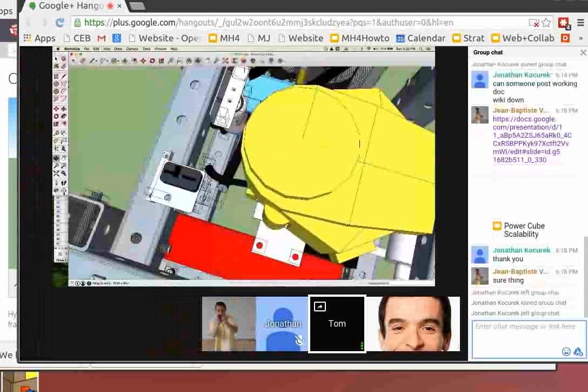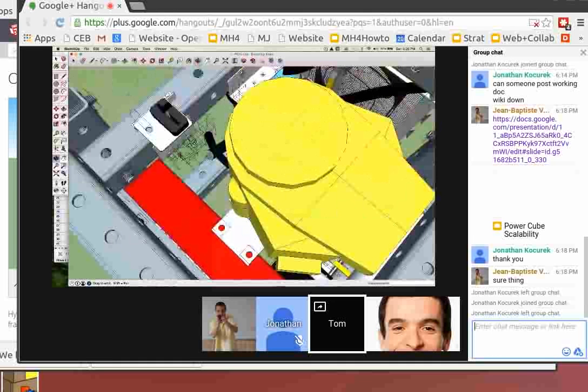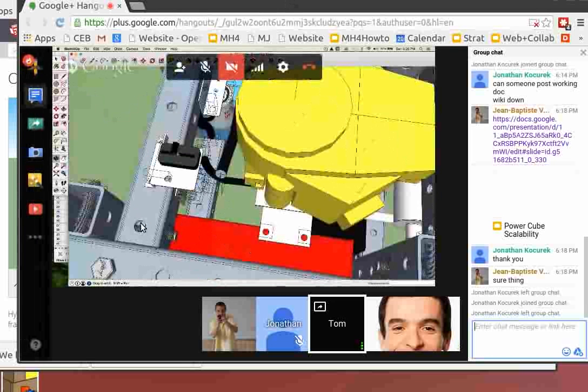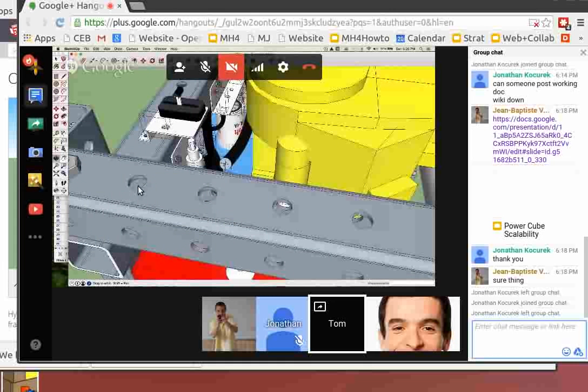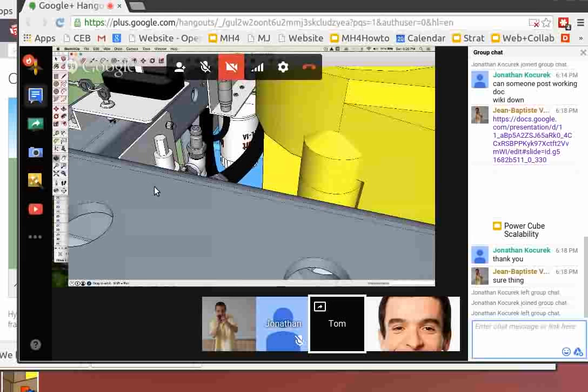And then the other two panels. Because you want two of them to go in through one hole? That's the idea? They cross through the same bolt holes, yeah? Yeah, that's a 1-inch hole and 3/8 bolts. That's good. Now the one thing is this. Maybe just use like 1/2-inch bolts. Okay. You think they would fit? I guess they should fit, because the hole is 1 1/16.